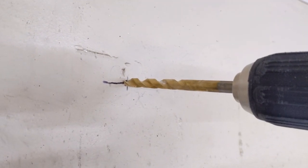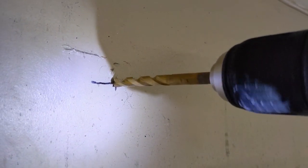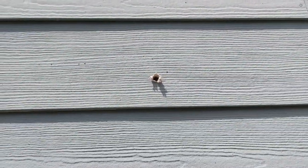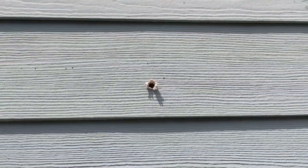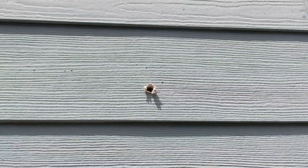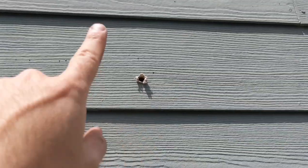If this bit isn't long enough, I'm going to have to pick up a bigger one — obviously when you're drilling, it's easier to start small and then go bigger. Using a longer bit, I was able to get through. You can see where 18 inches up pops through on the other side. It's a little below center, but that's going to be totally fine for mounting our bracket. Next, I'm going to run the wire through to get just enough slack on this side that will allow us to run it all the way back to that outlet.